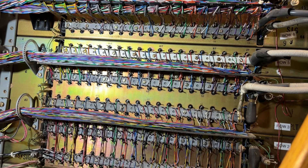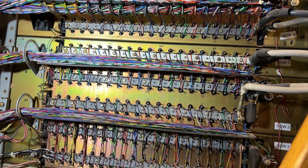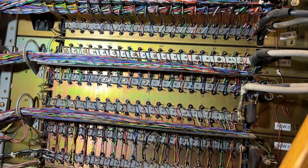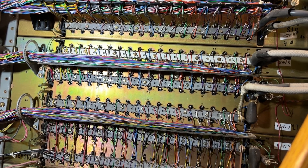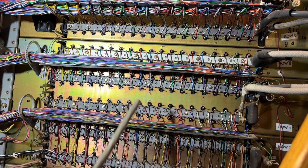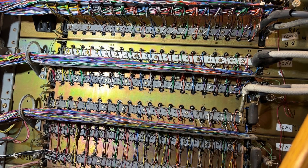The original concept I was told was they wanted less than a quarter of a volt drop. When the commercial power dropped off and you were running on batteries, that's when it was very critical. If your rectifiers are on AC power, they're floating the batteries around 52 to 53 volts, and at that point the drop would be nominal — even a quarter of a volt drop is nominal. It depends on the distance between the fuse and the trunk. My particular machine here is set up the exact way that Western Electric did offices. In a big office some of the offices I worked in had a relay rack that was 11 and a half feet tall, full of these panels, and they may have had one, two, or three depending on how many hundred trunks were in the office or auxiliary equipment.